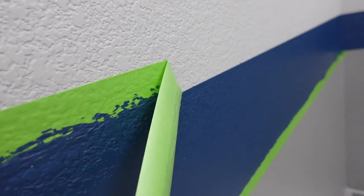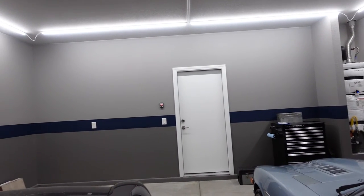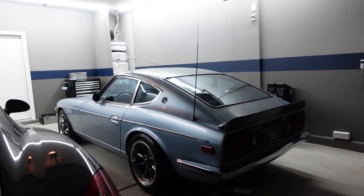I'm going to keep taking off the tape, put all the outlet covers back on, clean up the garage, and show you the finished product. The garage turned out really, really great and I am super stoked with the final result. It just takes a little bit of planning: a lighter color on top, a darker color on the bottom, and whatever accent color you want in the middle. Remember to buy your clear and white caulk for the clean lines at the ceiling and along the stripe. If you have any questions leave them in the comments below — if you liked the video give it a thumbs up, subscribe to the channel, and I hope to see you guys in the next one. Thanks for watching.